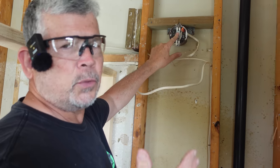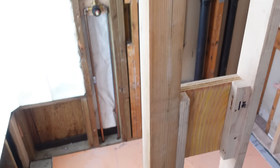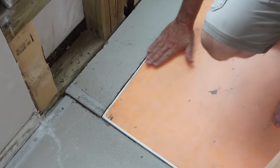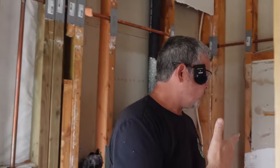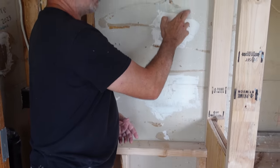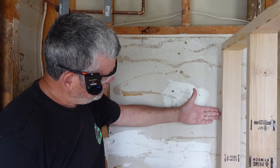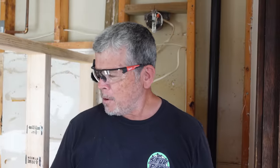This light is not in the center, so we're going to take advantage of what we're doing now and center that light — maybe even flip it over and put it on top so it's a little higher. This is remodeling at its finest. Rad's already bringing up the backer board from downstairs. Let me hop in the shower real quick — this came out great. Nice flush here, nice slope to it. We brought some KERDI with us to go over that and up the wall. Now over here in this corner — remember this pocket built into the kitchen for the refrigerator door handle — we've got nowhere to put screws for our backer board, so we're going to use adhesive. I'm tired of talking, ready to start working. Y'all do backer board and let's come back in an hour.